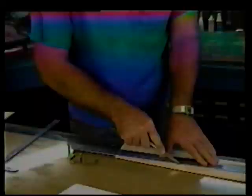And I've laid out the flaps on a piece of quarter inch, nice straight quarter inch. One of the things we're looking for in a flap, needless to say, is a piece of wood that's not going to warp and twist. C grain would be your first choice if you could get some. I don't have any. I'm going to be forced to use this. This looks like about a B grain piece. C grain would be better.